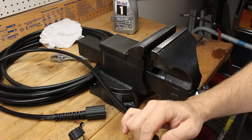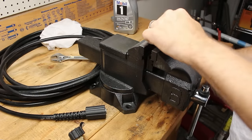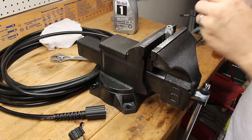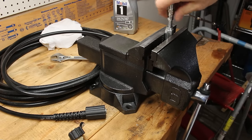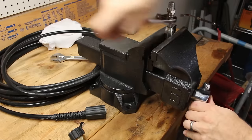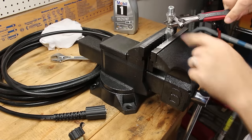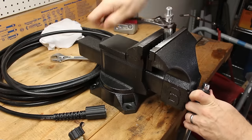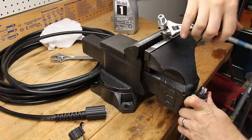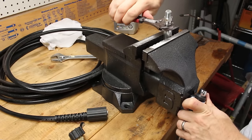To connect these two pieces together it will get pretty tight, so you can either use two adjustable wrenches, or like I'm going to do, just put one end of the hose into a vise and use one adjustable wrench to snug it up. You do not need any Teflon tape or anything for the threads on this piece — this is strictly a compression fitting to make the seal. Tighten it down the entire way until the two pieces meet and are snug.